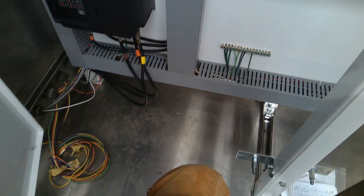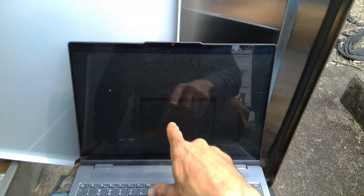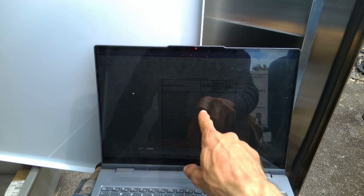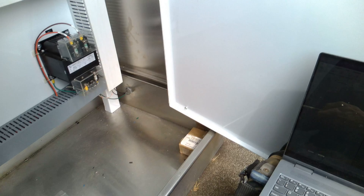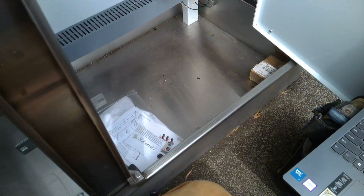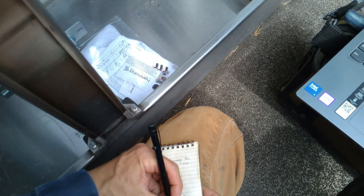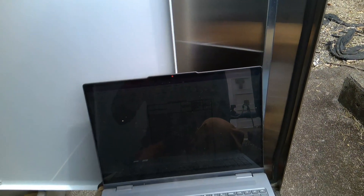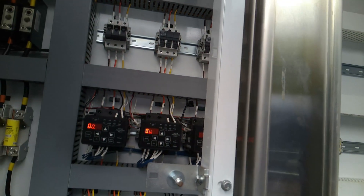Now I've got my fault codes — let's find the fault code chart. Here we go: fault code number 7 is 'OLA' — overload during acceleration. So fault code 7 equals OLA overload. Both pumps 2 and 3 overloaded — that's their most recent fault.